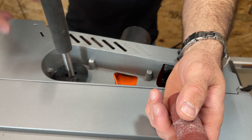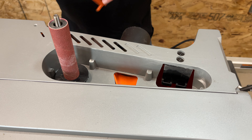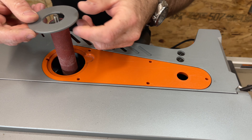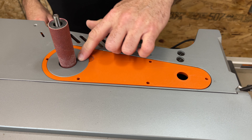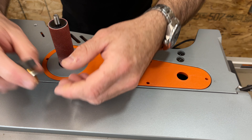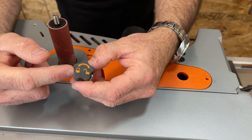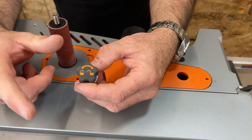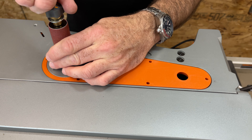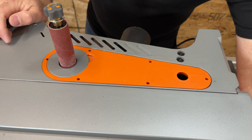For assembly: you put the rubber piece on, then put the sanding drum over it, install the throat plate of the appropriate size, then get the appropriate size washer and put it on. You get this nut, which is reverse threaded — righty loosey, lefty tighty — and you tighten it down. The washer squishes down on the rubber piece inside, keeping everything nice and tight. Then you can plug the tool in.